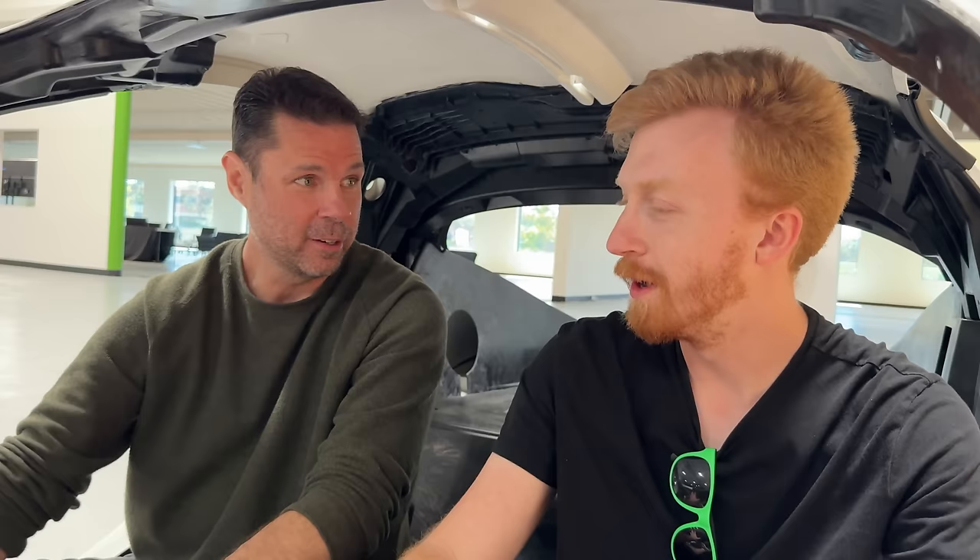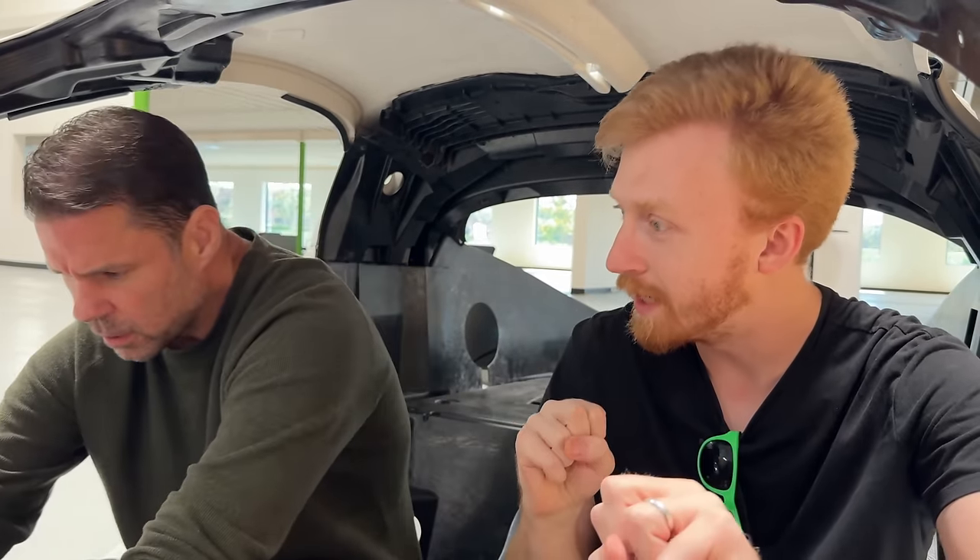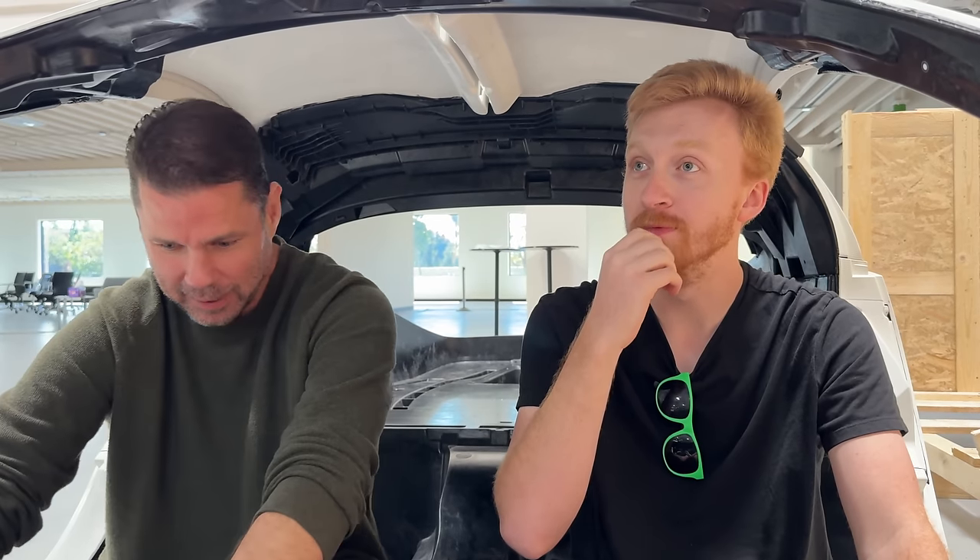Have you picked out a CPU supplier for the infotainment? We have — we're co-developing it with a very impressive company and will have a full release announcement. There's a concern about phantom drain — like Tesla's phantom drain throughout the day — and we're way more concerned about that because we have such a small pack. Drawing 30-40 watts as phantom draw out of a pack for a couple of weeks is not good, so there needs to be up to four kilowatt hours of just net energy on top of what the car uses.